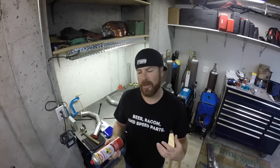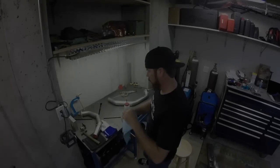And whenever I clean tubing that I'm going to weld with this stuff, I usually wait a little while before I do it. I don't go right from hosing it down with brake clean and then head over to the welding table and just start burning tubing. Because you never know, and I want to live. But if you're still freaked out about using brake clean, I should have told you this before, but you can use acetone, denatured alcohol, hell, soap and water if you're really spooked. So don't worry, still alive, still doing things my way. Might not be your way, but I'm not dead yet.